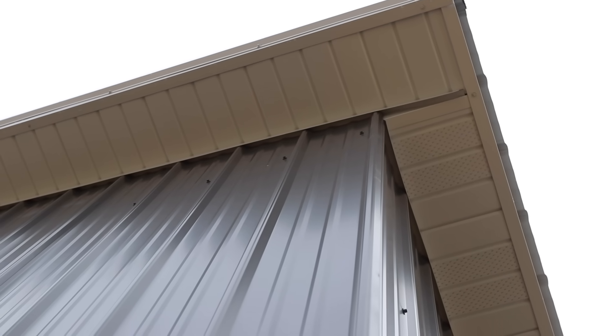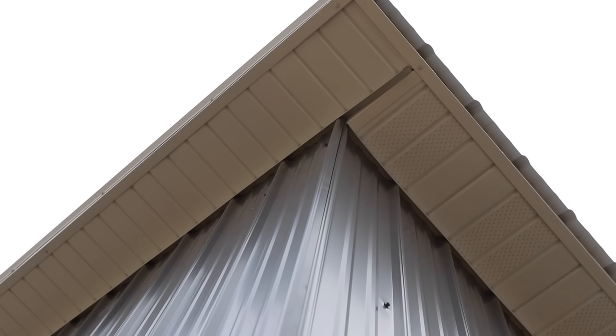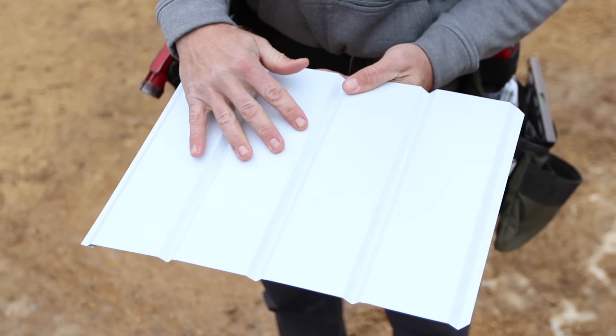Now that we've talked about stopping air infiltration, let's talk about the air that we do want, which is going to come from your vented soffit. Typical post frames you might see have no soffits, and what happens is they sweat a lot because condensation builds up inside with nowhere to go. Our number one priority is always ensuring we install a vented soffit, but we only vent the eaves. We want solid gables so the air makes an easy in-and-out exchange with the ridge vent, working like a chimney from your eave out through your ridge vent.